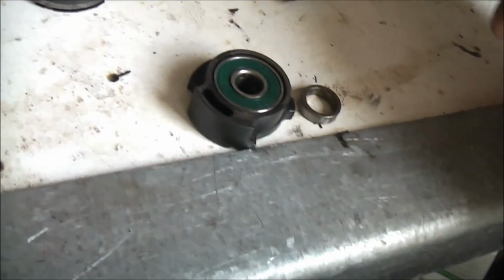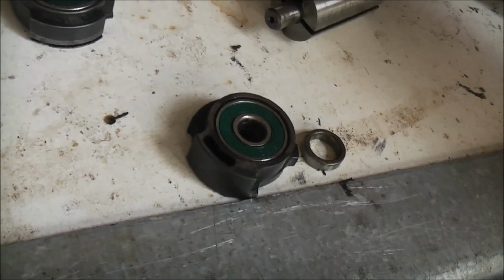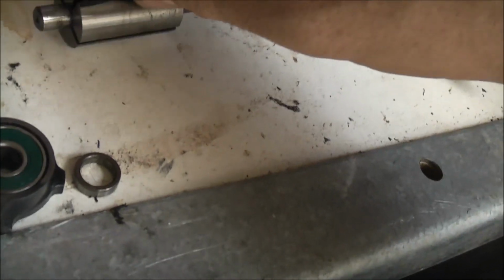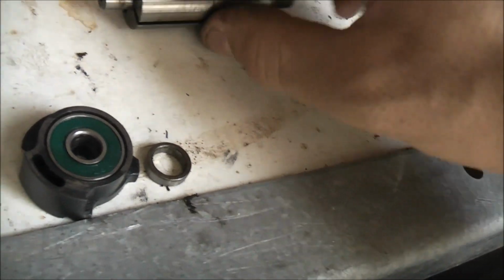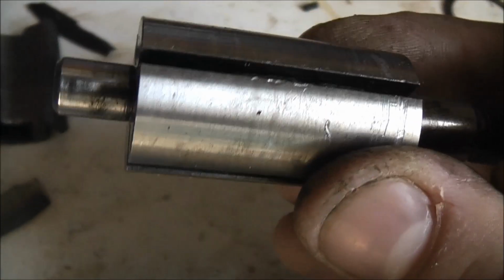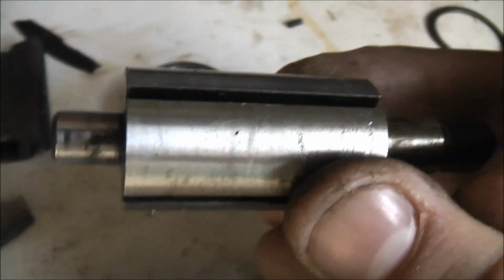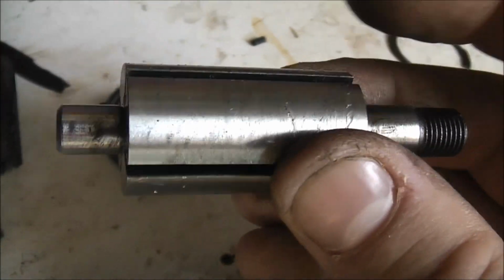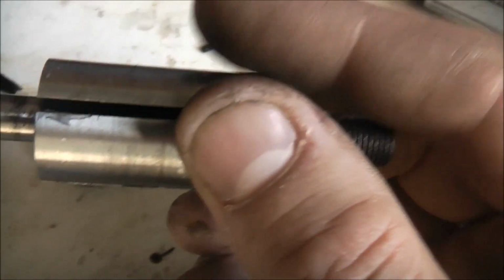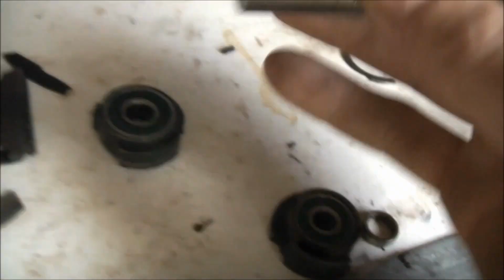Mylar in there. You see the wear on the side of that. That wear mark is from when that would have been wriggling sideways in there. Goes that way. You see, it's about 3mm. That's sitting completely flush. Now normally it's supposed to be a millimetre from flush. It's supposed to be almost flush with the end of this when they're new. The edges of those vanes, so had a lot of use.